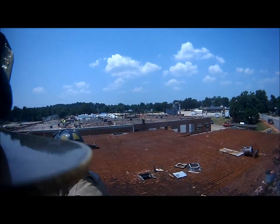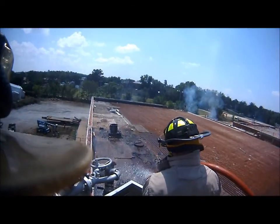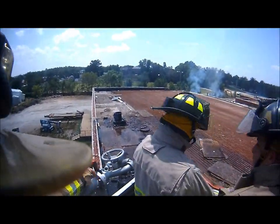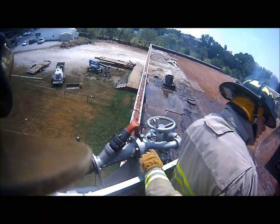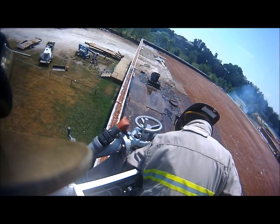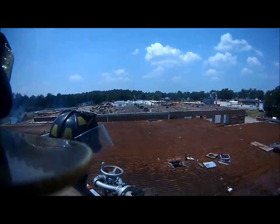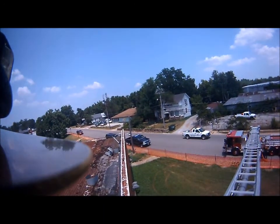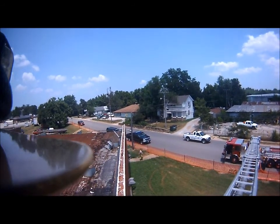Okay, copy that. We're going to shut our water down. Just go ahead and leave that open and that'll help — leave it wide open. And we'll leave the sprinkler open. Chris, on your side there's a little black plug down here that you pull — it's a little drain spout. You see the black plug right here on the side? At the bottom of this five-inch line there's a little drain spout. I see it. Okay, pull that pin and it'll let that drain. Then they're going to open up the waterway down there and then we should be able to start to retract.